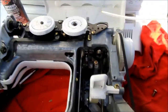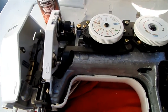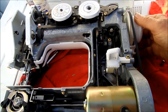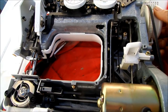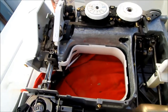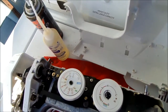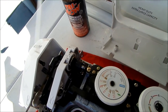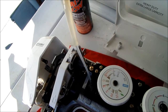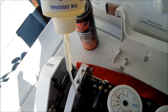There are several parts up here that should be oiled — this main shaft here and the main moving parts. You can tell the moving parts by simply moving the mechanism and looking for what moves. You just want to put a drop of oil on all the moving parts, except for the parts that have felt on them — you want to saturate that felt but don't overflow it. Make sure all the moving parts have a drop of oil on them.